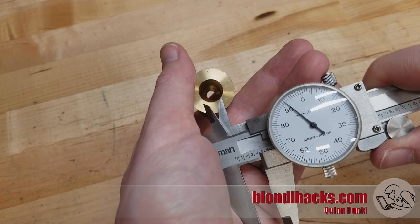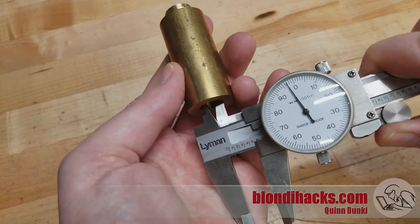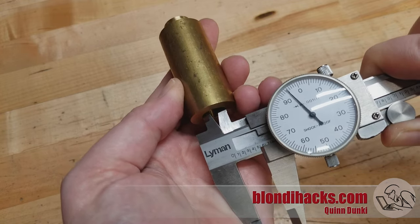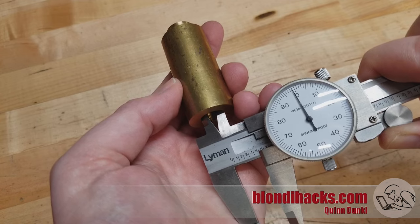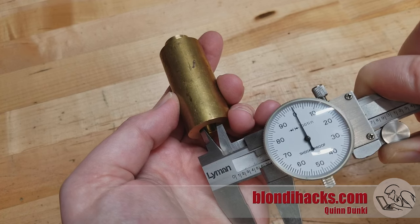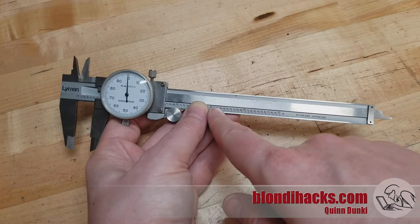The risk with this technique is that these thin areas of the jaws are even more susceptible to angle errors. So it is more challenging to get this part of the jaw square to the work. When it comes time to measure interior dimensions, we've got these little jaws on the back. These guys are again a good approximation, but don't rely on them when precision really counts. The main issue with these little jaws for interior dimensions, especially on round bores, is that it's very easy to get misaligned. You can get a lot of different readings depending on exactly how you hold the two pieces relative to each other. When in doubt, feel around — the largest reading you can get will be the correct one, because that's when your jaws are most parallel to those surfaces in there.